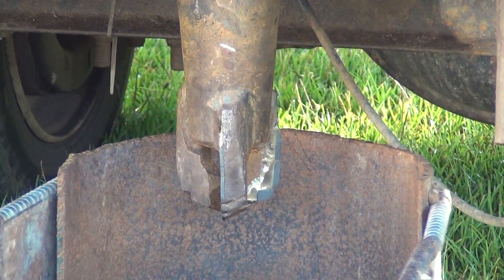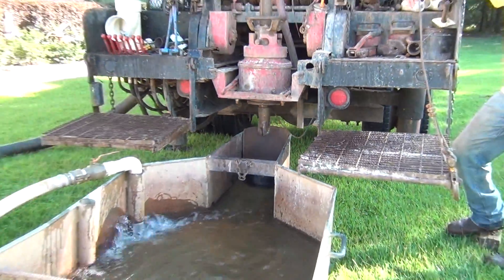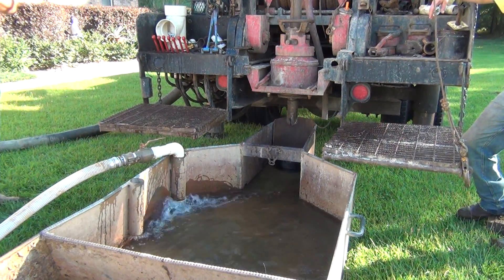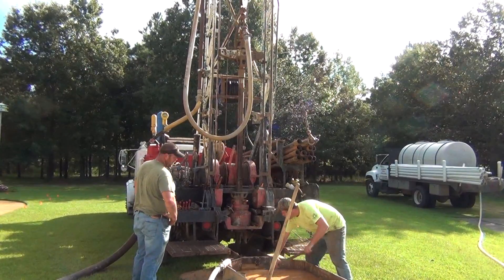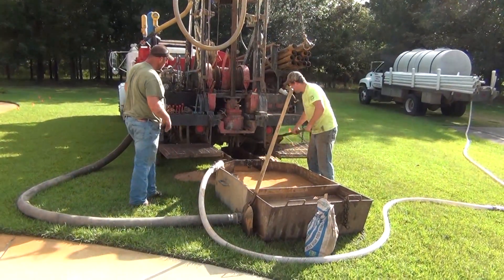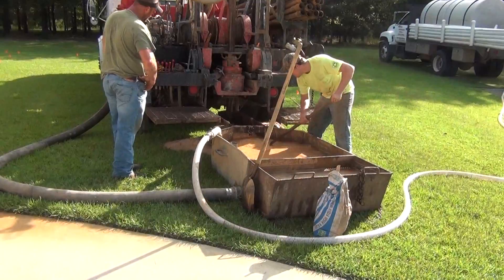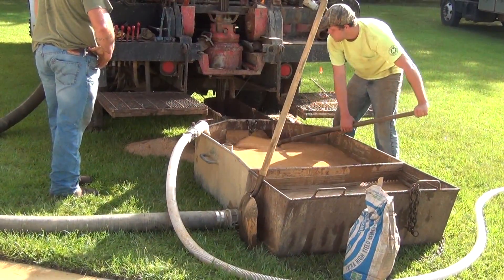This is the drill bit that will be used to drill the wells. Water is pumped down through the drill stem and cuttings are washed back up to the surface in the annular space between the drill stem and the edge of the hole. The cuttings in the form of sand and clay must be continually shoveled out of the portable mud pit.